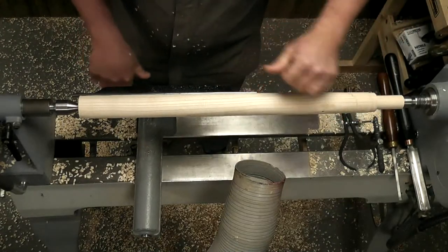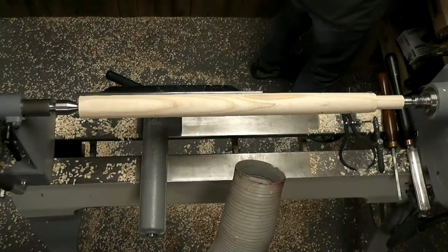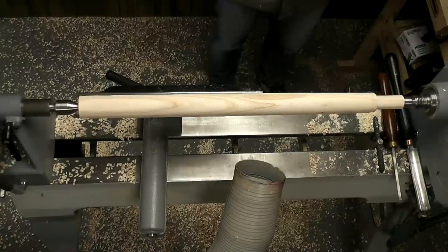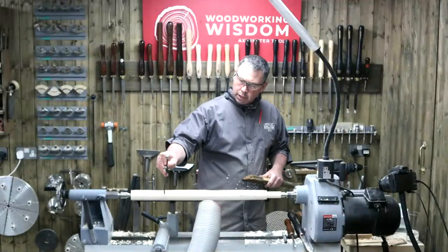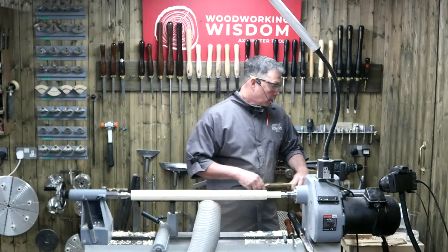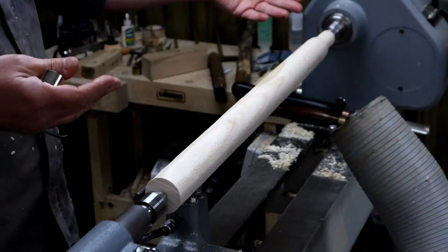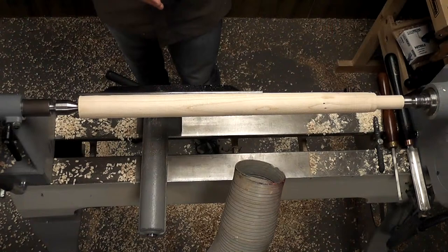Yes, Ben. So a question from Paul here, Colwin. How do you keep a long spindle concentric diameter if your tool rest does not go the full length of the workpiece? So it's measure. Do what I'm doing here, measure. Calipers, so do several measurements all the way along, join the dots, as it were, and keep going with that. It's the only way. Even this way, there's 14-inch tool rests. It's still not going to span this. You can get double stem tool rests if you're doing a lot of production, for instance, but that would be the only way. Just measure everything.